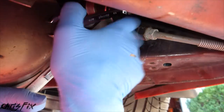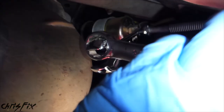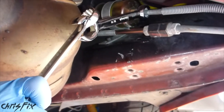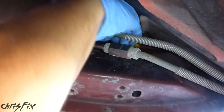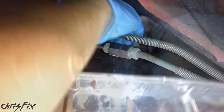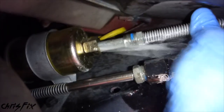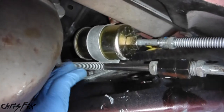Now that's not going to come off easy, so here's a trick: slide the closed end of another wrench over the opened end of your flare nut wrench. The longer your wrench, the more torque you're going to have to remove a nut or bolt. Now we can hand loosen the nut — remember to wear your goggles so gas doesn't get in your eyes — and just let it leak out and drain.